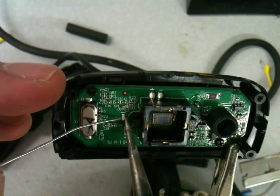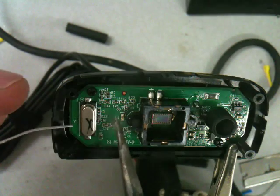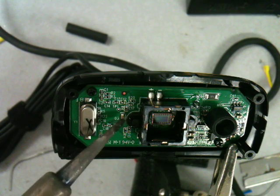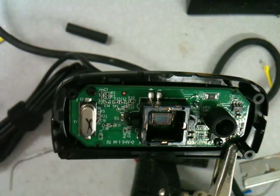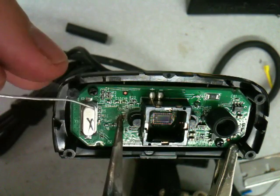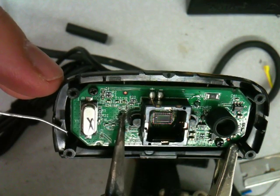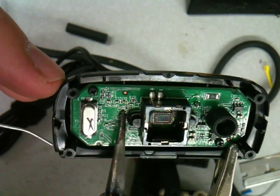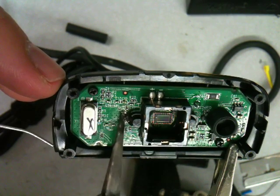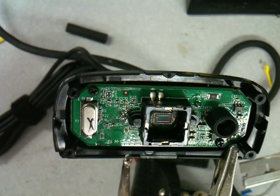What I found is that if I apply a little bit of solder, I can bridge the gap between the electrodes. I originally did this to try to short out the LED, assuming that would prevent it from illuminating. But what I found is that the solder actually provided thermal contact to both sides, causing the LED to desolder and adhere to the soldering iron. So I was able to simply remove it from the board. The LED is now stuck to the end of the soldering iron — I'll call that a success.